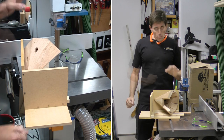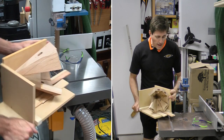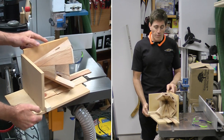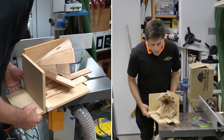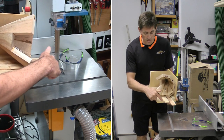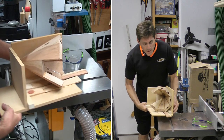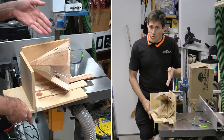The first cut that I'm gonna be making, the one that's on the back, the way that I'm gonna be doing that cut, and a lot of these techniques are just gonna be reused for the other cuts, so I'll explain this one first, is I have this line drawn already. What I'm gonna do is cut a V-groove out here. Nowhere touching this, but just as close as I can to get to the octagon. And what that's gonna do is it's gonna give me a way of getting the blade really close to where I need it for the start of the cut.